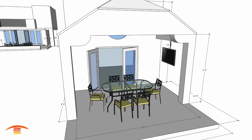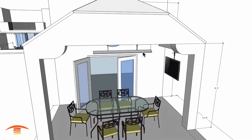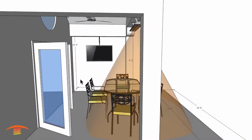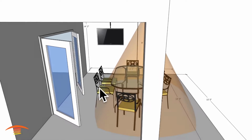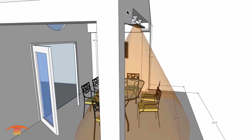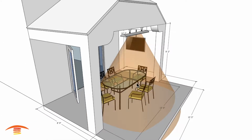And I think I have that right here. So that would be another 6,000 watt unit here. And we're going to go ahead and it's just centered within this space here. And the footprint of heat will look similar to this. You might want to angle the heater slightly inwards if you really need to get the seating heated up over here. I have it so that the table and chairs, the table itself is just at the same location as this outer edge of the patio section. So that meets right there.